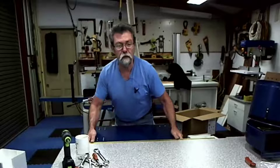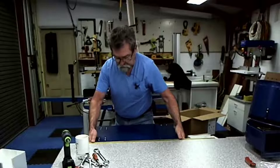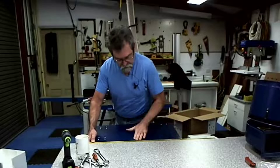Now, regarding height up and down, I clamp a piece of timber, a straight edge piece of timber, right across either side onto the saw. And then I pull the wing up till it hits it, and I put a clamp on there as well. And that holds it perfectly flat. Do that either side, tighten the outside ones up, and then you may have a dip in the wing. Cast iron is malleable, it will move.